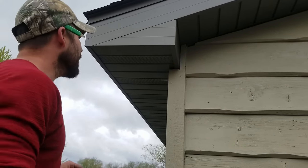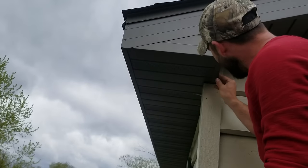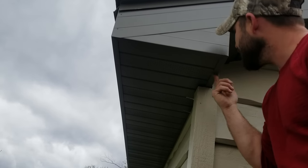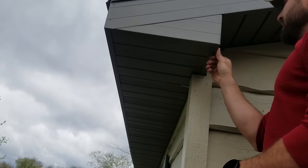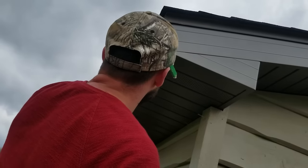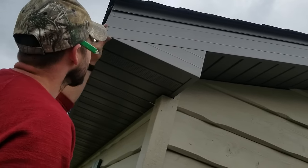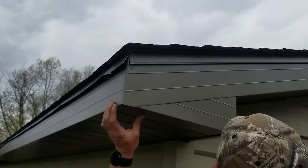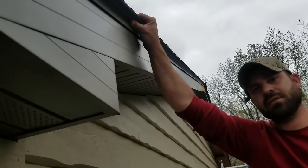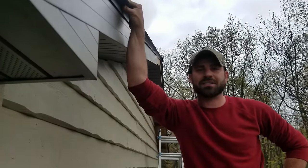To recap again: we want to get our bird box on nice and solid — nails on this side, nails on this side. I usually don't try to put nails in this edge because it can buckle once in a while, but mine's sitting pretty good. So we want to do the bird box first, then our horizontal eave fascia and wrap that around, and we want our gable fascia to come right down flush with this edge and flush at that bottom. That's how it's done. If you guys have any questions, leave them in the comments. Thanks everybody for watching and making these videos possible — don't forget to subscribe.